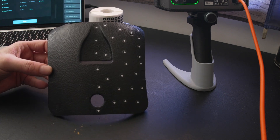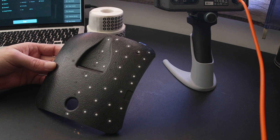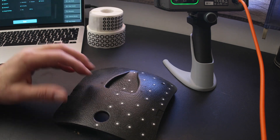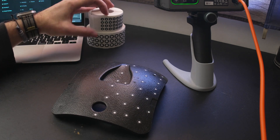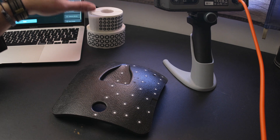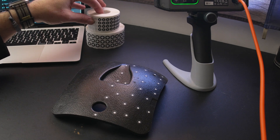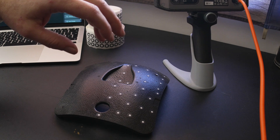The CR scanner. Let's put some dots on this now. I've already placed some 3mm markers on this piece - just on half of it - to check if the scanning is actually working with the help of these points. In terms of configuration, because I want to use both sizes of dots, we're starting with the 3mm ones in small mode with markers, and then I'll try the 6mm ones in medium with the same part.